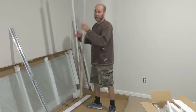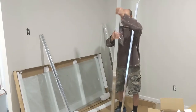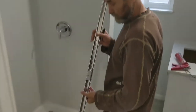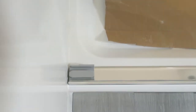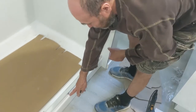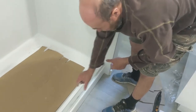Next step, I need the steel pieces — this is the side one, the vertical track. I'm just gonna remove the plastic. In this case I'm gonna put it here because I need to mark to cut some holes. I'm gonna set it up about a half inch from the shower. I can put a little mark in there. The reason I leave about half inch is so that once you caulk it with silicone, it will look better if you leave a little bit of space in there.